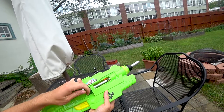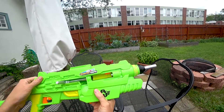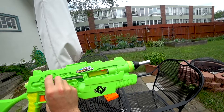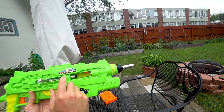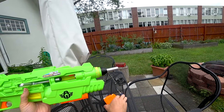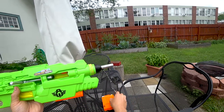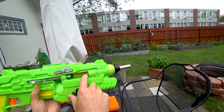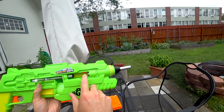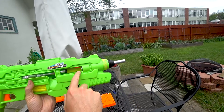I've got a K26 in here — it's really hard to prime with one hand. The breach goes back so the dart can actually fit in. The cool thing about this is this little nub. What I was running into before was how to keep a dart, which pops up on the magazine, pushed down while also having something that can push into the barrel to create a full seal. Buzbee's already solved it — it's a spring that pushes the dart down and centers it.